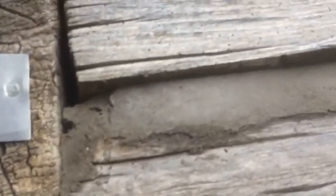But the main thing with chinking, if you don't take anything else from this video, if you notice, I've got a space right here. This is a drip edge. On the top log, you always set your chinking in. I set mine in about, I don't know, that was about 3/4 of an inch, a half inch to 3/4. Maybe an inch is probably a good number. It depends how big your crack is. And you bring it out flush with this bottom log.